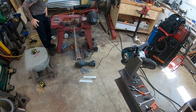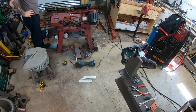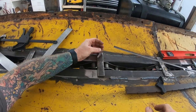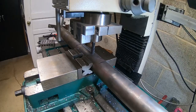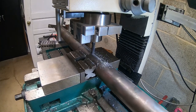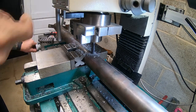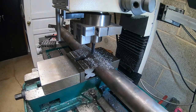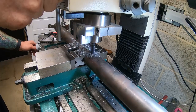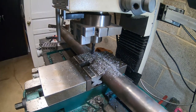The infeed teeth I made out of some — I think it was inch by quarter inch flat stock — and I just cut basically little triangles out, then I'm going to weld these onto the brackets. It was 40 of them all together. This is the drive shaft for the other end; I never put the keyway in that one, so I had to cut that one so I can roll the chain around as I weld each tooth or each set of teeth on.